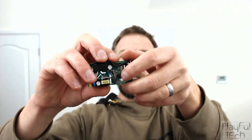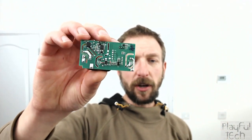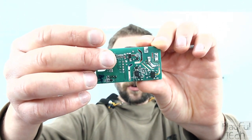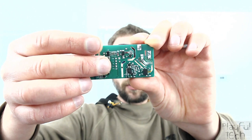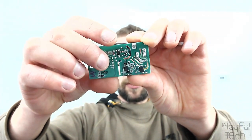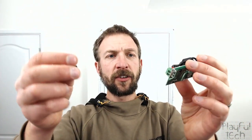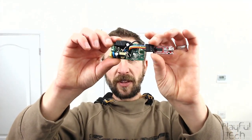To do that we need to reflash the chip with some new firmware. If you look on the back of the board you'll see there are some pins here - we've got ground, transmit, receive, and a 3.3 volt power input - and those empty pin holes are connected to the ESP chip. If you solder some pin headers onto those pins, you can then get an FTDI programmer like this one, connect the USB to your PC, and run software to upload new firmware onto the chip and change how it behaves.